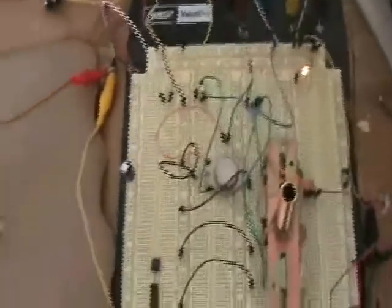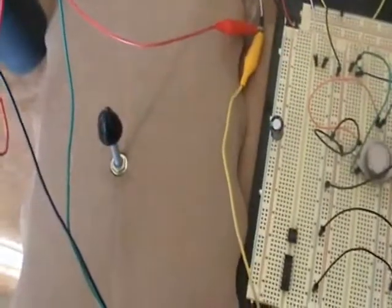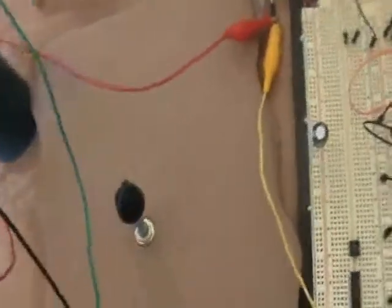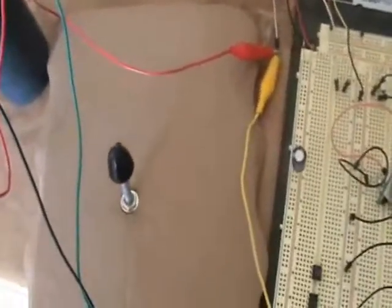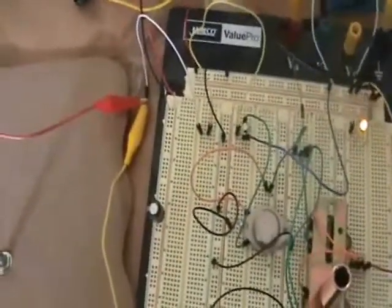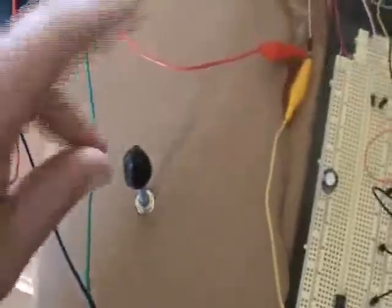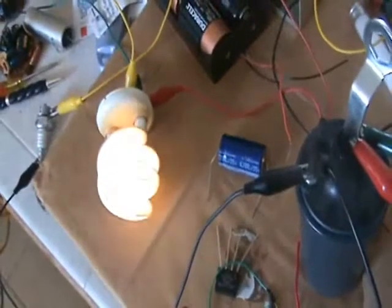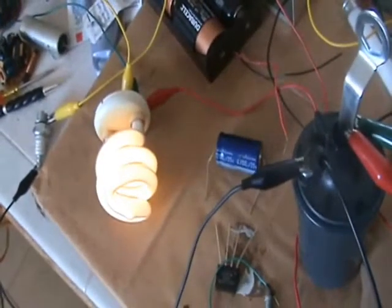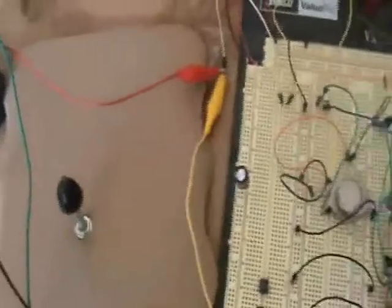Aromas had hooked up a 5 megaohm pot, and if you think about it that's really a crude coil — there's natural capacitance happening, so we do have a tank circuit going into the transistor, sort of an implicit tank circuit. This thing self-resonates to wherever it wants to resonate, with minor adjustment from the pot. You can tweak the pot, changing that tank circuit, to try to find the place where it resonates best.